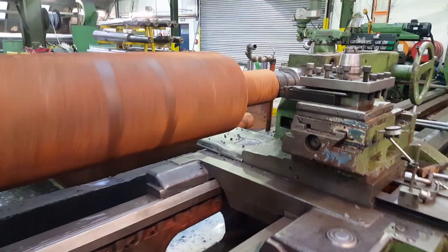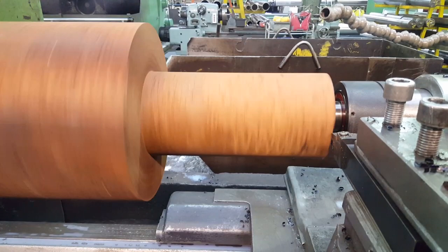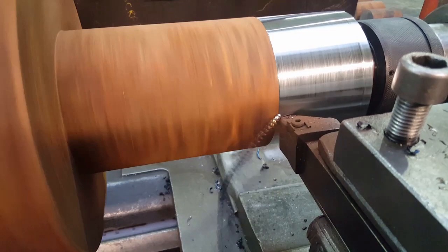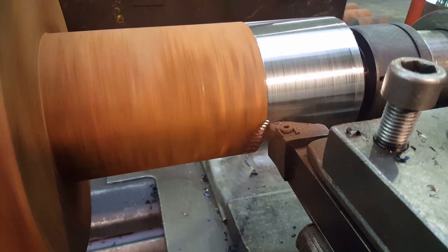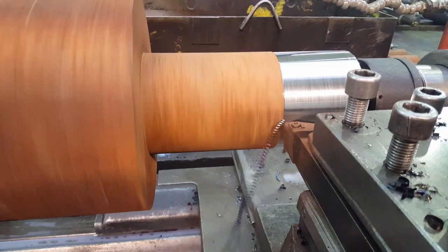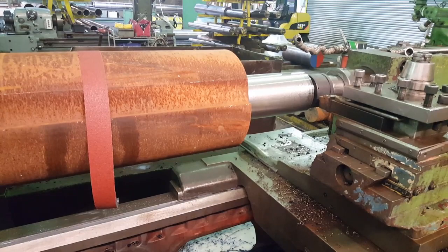So I'm taking 125 thou off the shank. This is a six inch shank and the machine that I'm working on is five and seven eighths — 125 thou. I'm using a CNMG tool holder, my least favourite tool. Chris Madger's favourite tool. That's the shank finished.